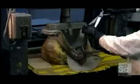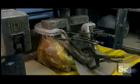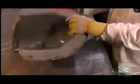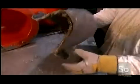He lowers a 1-ton press to compress the layers of fabric as the resins between them continue to form a bond. He adds some clamps to keep things tight. After 20 minutes, he pries the laminated fiberglass shell out of the mold. This is one very tough shell. It's the raw form of a goalie mask, but it still needs a lot of work. So it's over to the trimming and grinding station.